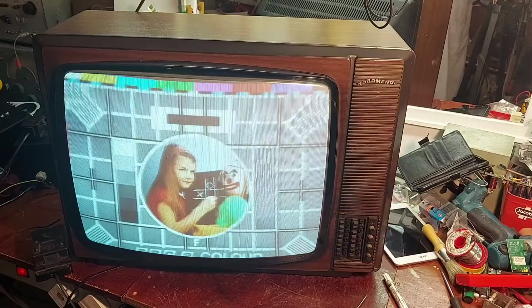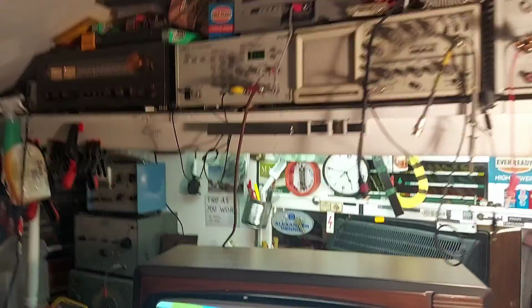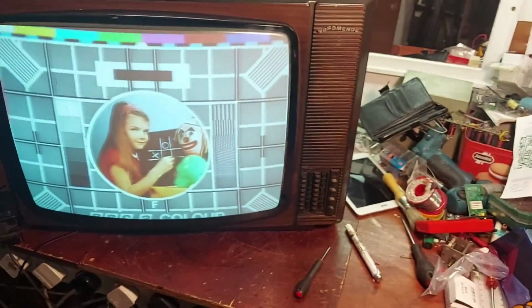Maybe we have a tuner fault. I'll tell you what, I'll float around with this for a few minutes. There's no point forcing you to watch this nonsense. Okay, I managed to tune it in, but the funny thing is, I'm on 65 megahertz. Oh, you can't see that. I think there's something wrong with it. I think it might have a VHF tuner in it, and there's something wrong with the band switching.